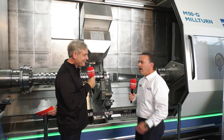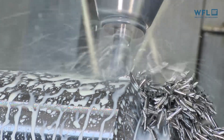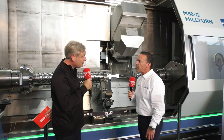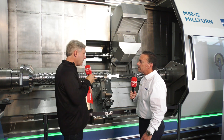There's also a lot of tooling. The machine can come with up to 200 tools, and there's also a robot tracker that keeps the next tool close to the spindle for minimizing tool change times — keeping that spindle turning. There's also a big B-axis, up to 45 kilowatts; this one is 27 kilowatt, tying in super powerful capability with those complex materials.